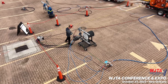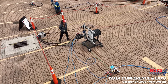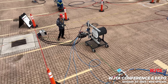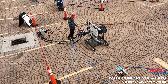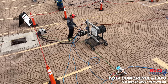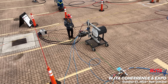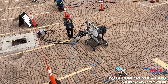Dan's going to be driving around a little bit. Triangulating movements based off of encoders that know where we're at, it's going to triangulate those values and make an accurate pitch center to center, tube to tube, and learn how to index those. Dan's already good on that point. Now Dan's going to go ahead and identify our boundaries within this sheet — we're only running the bottom half — contouring the sheet so the machine knows where to populate tubes and where each row terminates.